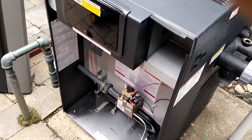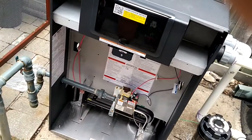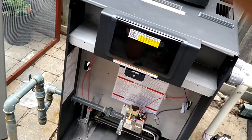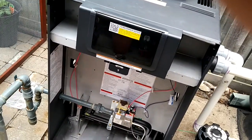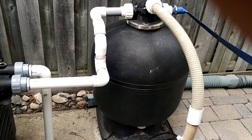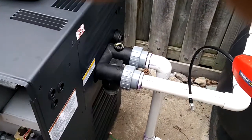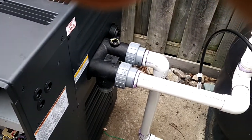It's very important to have that wire. I would say eight out of ten installations I see are missing that wire, especially on millivolt systems. These are inch-and-a-half return — that's our return, that's our supply pipe.